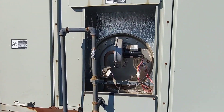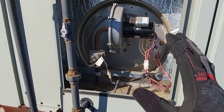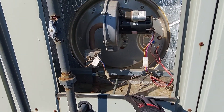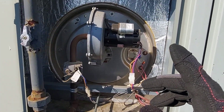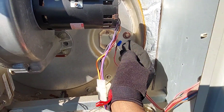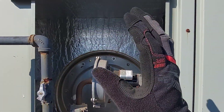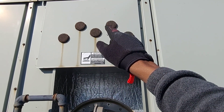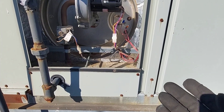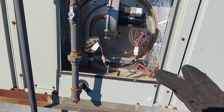What I'll be doing today: I have a Trane rooftop unit here and I'm going to fire up the heating furnace. I'm going to disconnect the igniter — it's a bit of a pain because there are wire nuts instead of a plug. With the igniter disconnected, we'll have natural gas coming out of the exhaust — unburned, pure gas — and I want to see if the detector can pick it up.